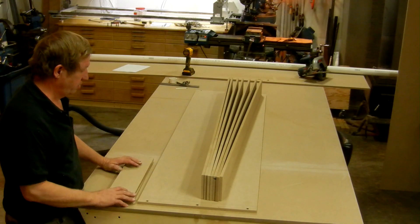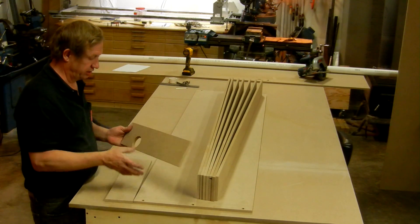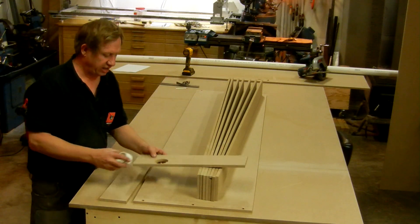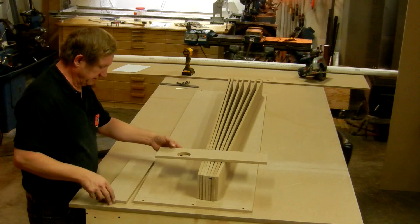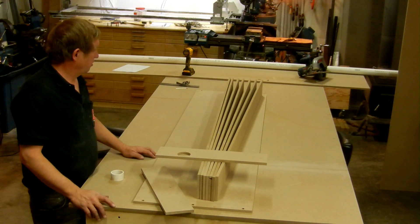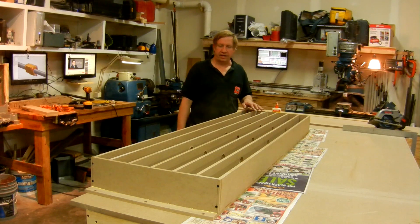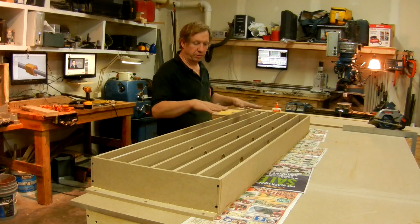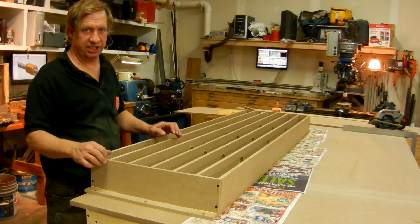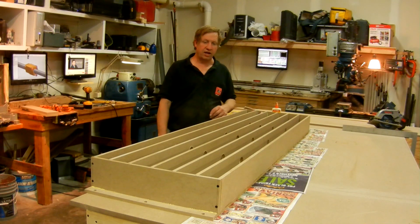Putting together the vacuum chamber — this is the tabletop right here, these will be the long-way supports, and here are the end plates including one that already has the hole for the PVC pipe. I'm going to use a two-inch vacuum line, so it's been bored for two inches. It gets mounted on top of those end frames with just some bolts. There's the vacuum chamber — I just finished assembling it. After it dries a little more I'll put the bottom on. This flange here sits on the end rails supporting the x-axis rods, and the vacuum ports right here connect to the vacuum source.